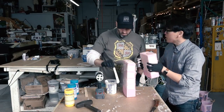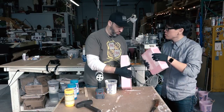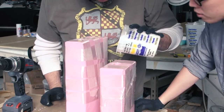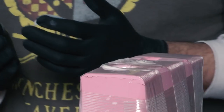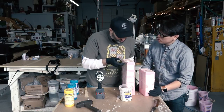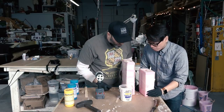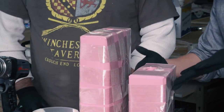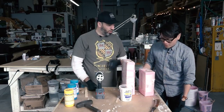The foam is mixed. Pouring a little bit at a time — you're not filling it all the way to the top because you know it's going to expand. I'm going to wait until it rises up a little bit and then put my thumb on the end to get a little back pressure and maybe force foam up into the tip. You can actually see it expanding right now in the mold — it's rising up, just about to come out. It's like a little soufflé. Turns out you don't need to put back pressure on this one — there it goes!